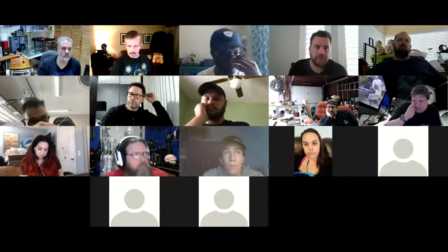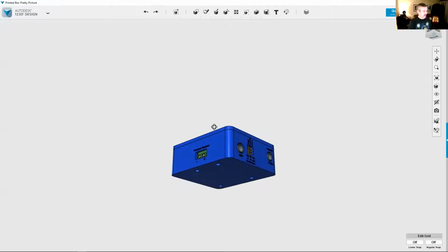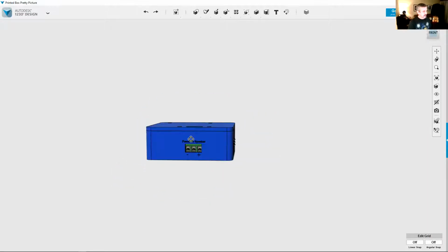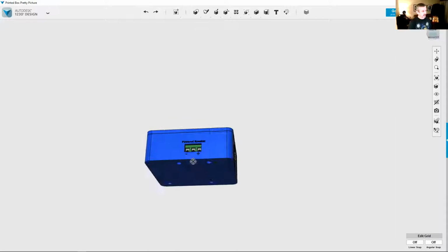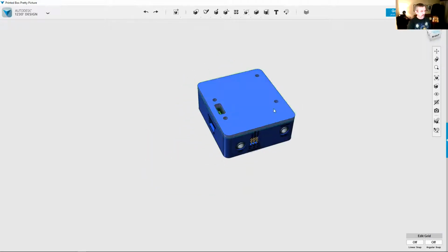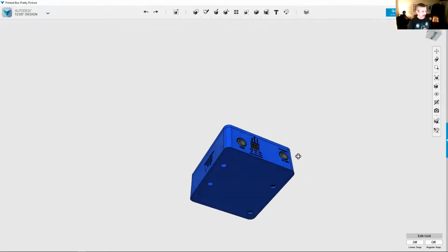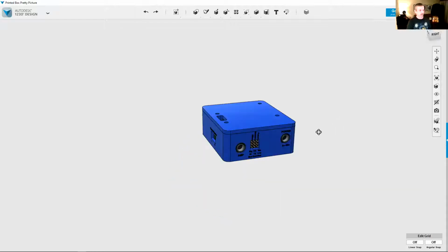There are, so hold on, let me reshare that again. What we can do, and if people want it, we'll share not the STLs, but the step files for this. I usually just put heat sets in here and pass the screws through that. Then you can mount the screws from the backside, bolted on through something. That's what I've done on the mouse droid or anything that I use the aluminum angle frame in. Two of these holes line up to those holes, and you just use a longer screw through the heat set, and then you can pass it through whatever you want to bolt it to.